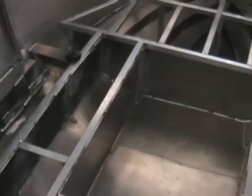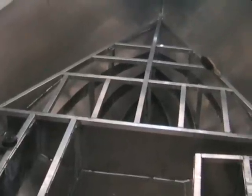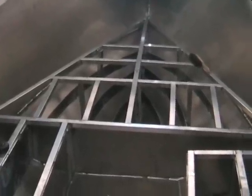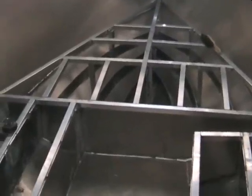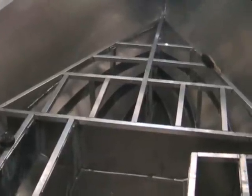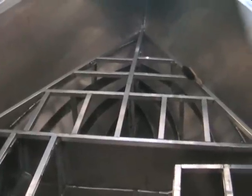The foam that's going in it, there's twice as much foam going in it as needs to be. It probably only needs 1.2 cubic metres, but there's actually 2.4 cubic metres going in it. So even loaded up with gear, it's pretty much unsinkable. There's no way you'd sink it. So 2.4 cubic metres means it'll float 2.4 tonne. So it's more than enough foam to save your life. Even if it did flip over in a big sea, you'd still have one big life raft to cling onto.